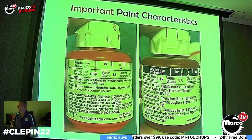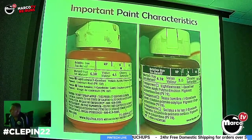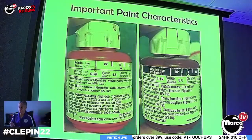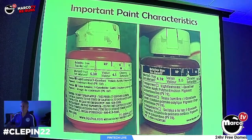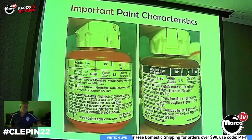In the old days, that's how the play fields were made. And actually, Chicago Gaming Company, I think it's the last company that still screen paints their play fields. And you just can't get the same color richness and saturation, and the look, if you digitally print stuff, it just doesn't look as good. But that's how we do it, we put a white layer down, and then we put the colors over the top of that. The ones that are transparent especially.